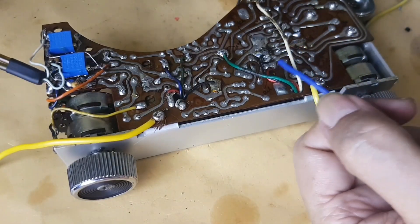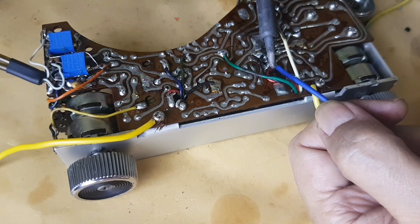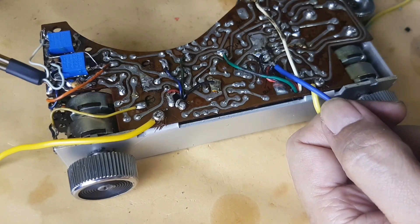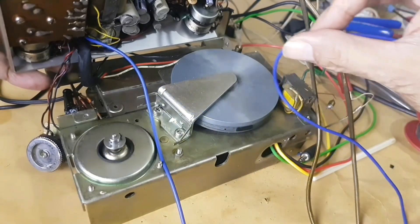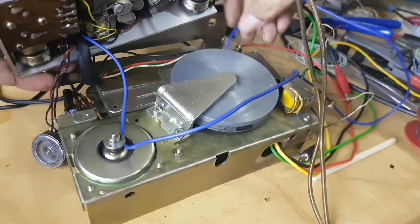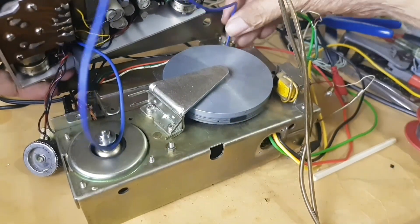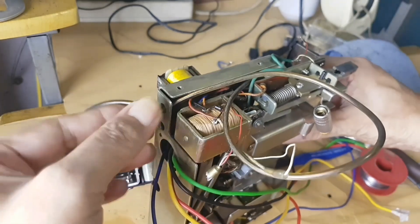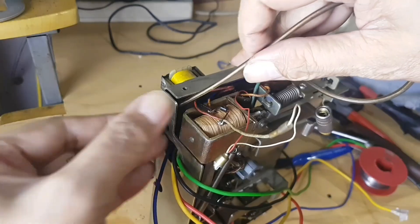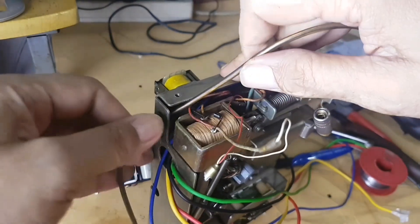This is an addition — the blue cable that I connected to the plus is useful for turning the external player unit on and off. The additional blue cable for the external player on/off control needs to be arranged. Two pieces of coaxial audio cable for input need to be tidied up too. It is best to choose a coaxial audio cable that is well covered by ground.